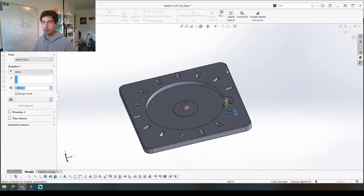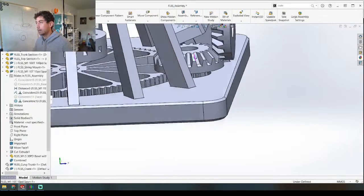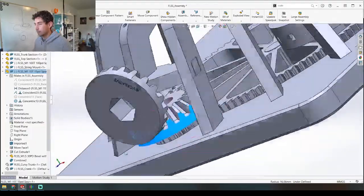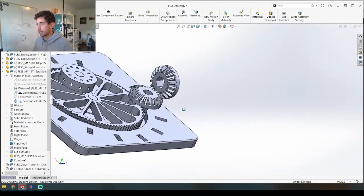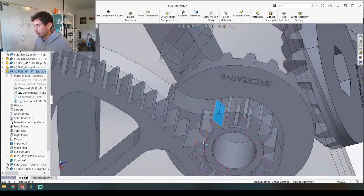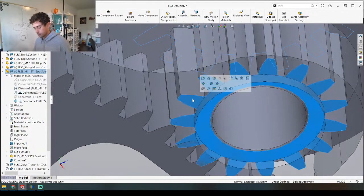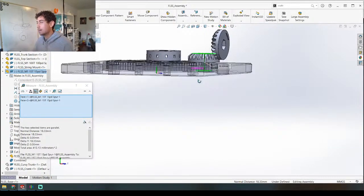Like I mentioned, all my shafts are 9 millimeters, and the holes are all 9.4 — that gives you a pretty good clearance for spinning and it works on most people's machines, which is a huge part of what I design for. Anyone who has a printer can download these parts and put them together without any additional tools. I'll do some of the finishing touches probably on my own. So yeah, that looks pretty good. Let's hide this so we can see this gearbox coming together. Let's make this transparent — so you can see this gear connects to this gear. This is sitting on the flange here. The shaft is going to come up through the center — we're going to adjust that right now. Let's first figure out how big we need to be: 18.33 — that .33 bugs me so much. But it comes from this bevel gear — I can adjust.